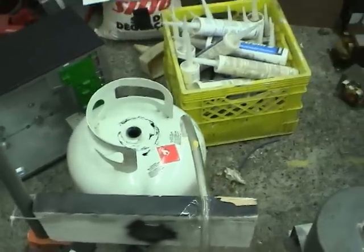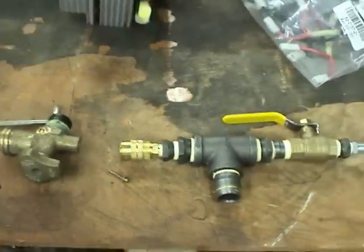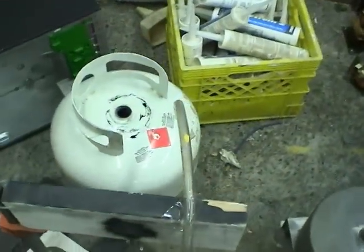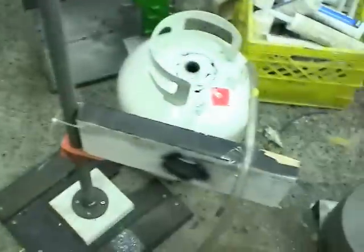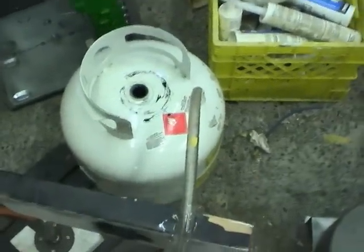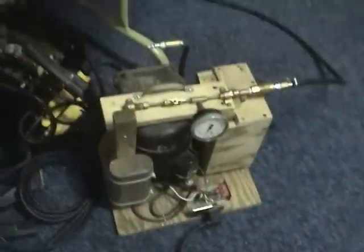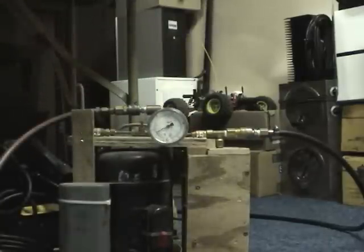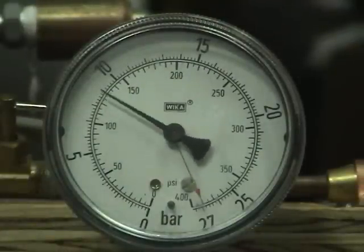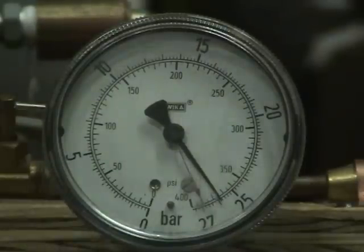The paint has dried thoroughly now — the fan's been running for about five days. I've made up an adapter to connect the tank up to the compressor and to your fittings. Pretty much the only thing left to do now is pressure test it. From what I've read, these tanks are tested typically to about 400 psi, and since I have a 400 psi compressor for that air cannon, that's what I'll use. Let's fill up the tank with water first so that if it fails it won't be a massive explosion. We're ready for the pressure test. That looks pretty good — release the air.